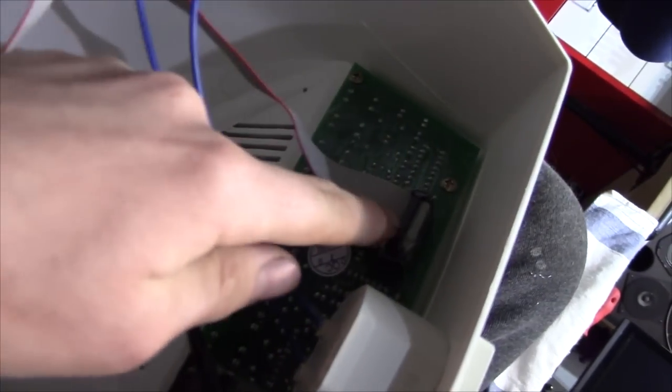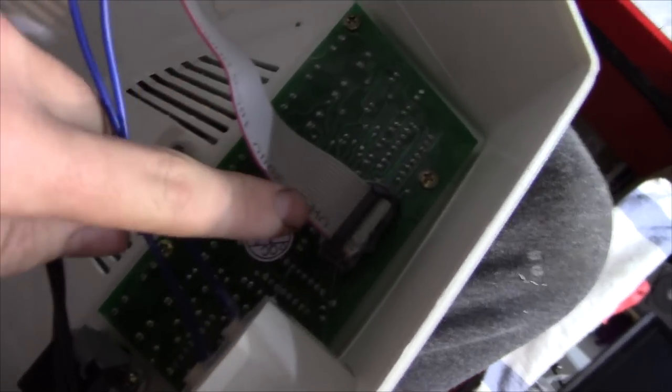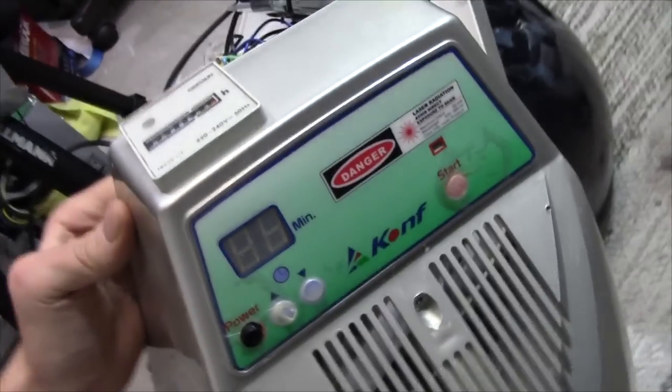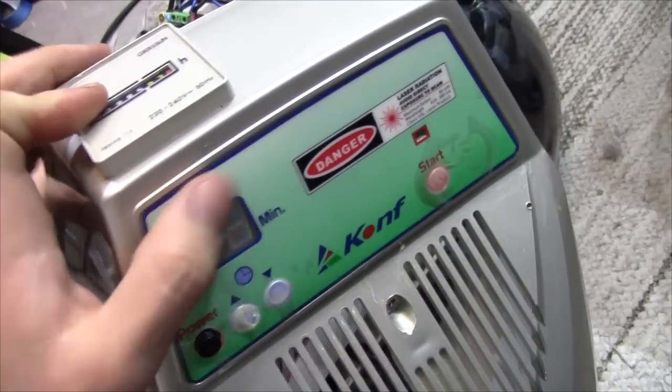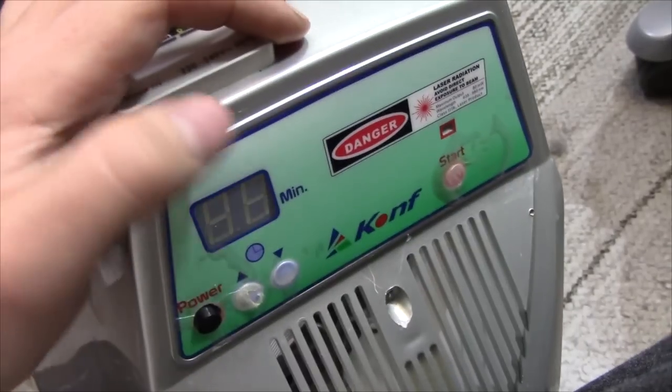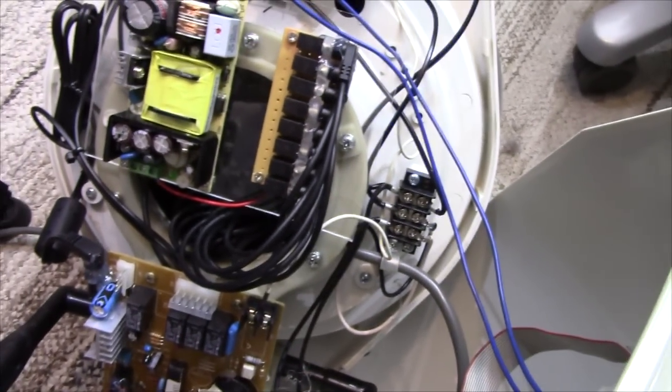They've installed their own custom main board, kind of. Or this could just be bodged, I'm not entirely sure. Well, no, this board is probably stock, they just have their own label on it, since it's just a timer board anyway. And the power switch is obviously bodged on though. It's a two-pole switch, which they've just used one pole of to break the mains, so this thing is entirely lethal if you leave it plugged in and work on it.